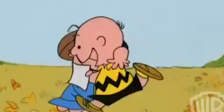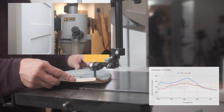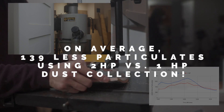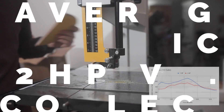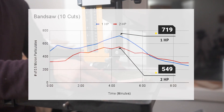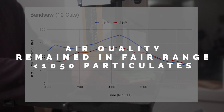The reason for that difference is that the air filter I used throughout all these experiments — a Powermatic unit — was set to medium during the two horsepower experiment and set to high for the one horsepower experiment. So barring that, during the cutting, the two horsepower with slightly lower air filtration allowed on average over the four minutes 139 less particles into the air. However, the peaks in both experiments were 719 for the one horsepower and 549 for the two horsepower, which meant that in general the air quality overall stayed in the fair range and never went beyond that.